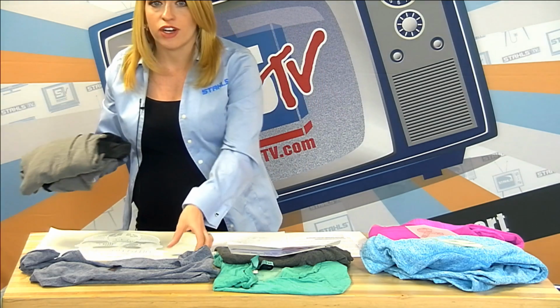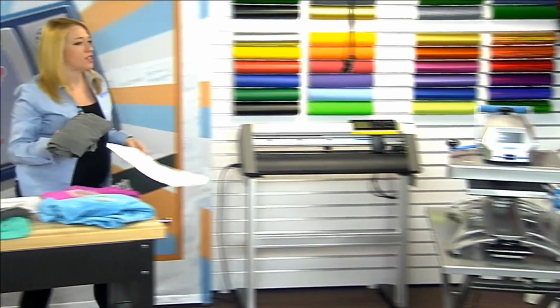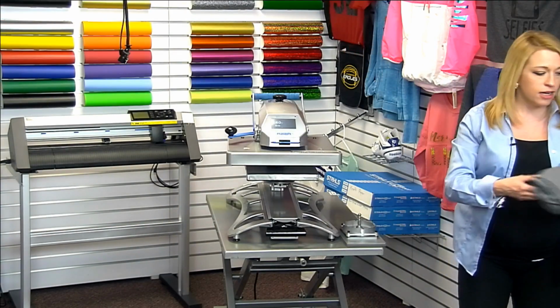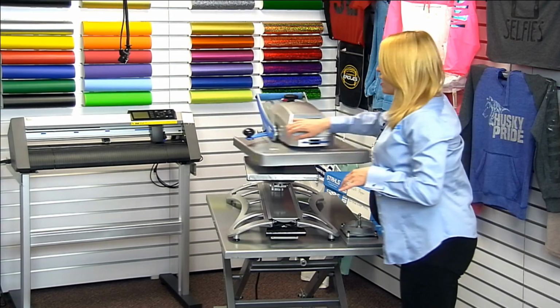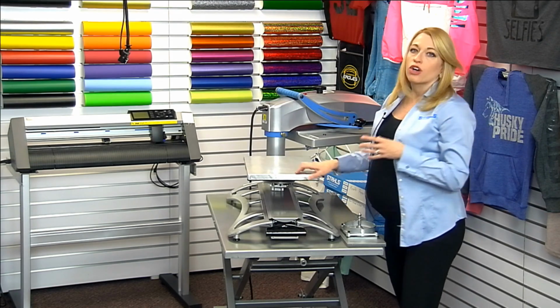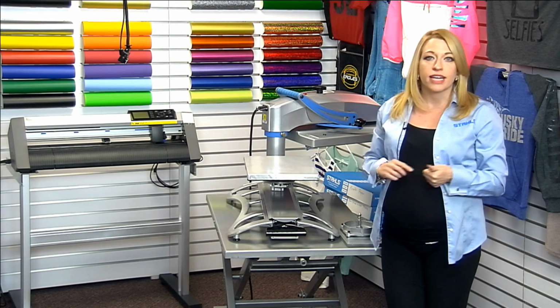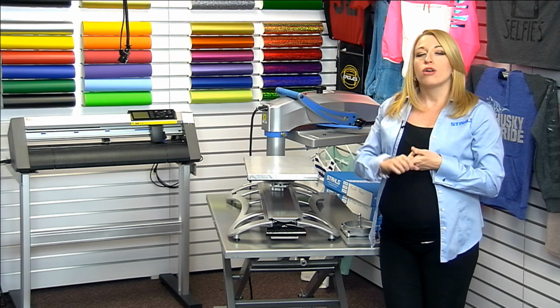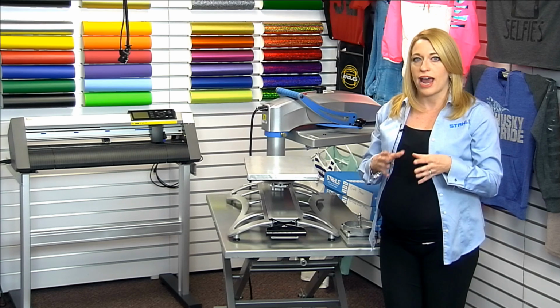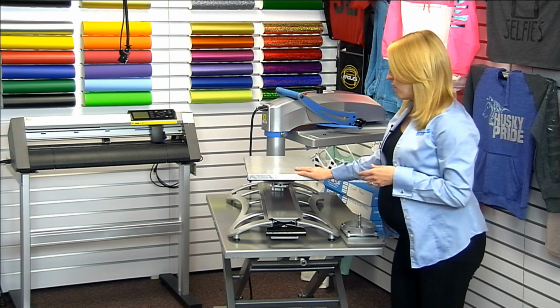And so it'll be a lot of hands-on demo here, and I'm going to get ready to kick into that and talk through 3 specific principles as I do the demos that are going to be really important for you to be successful. And so I'm going to head over to the Fusion heat press here. Now the Fusion is traditionally a 16 by 20 heat press. What I have done here is I've actually loaded in a 11 by 15 platen. This is going to be really important for the garments that I'm printing. One, I'm going to be using a lot of ladies garments throughout the class. I'm also going to be trying to remove seams and areas off of my press to ensure accurate application, and this will help me to achieve that as well.